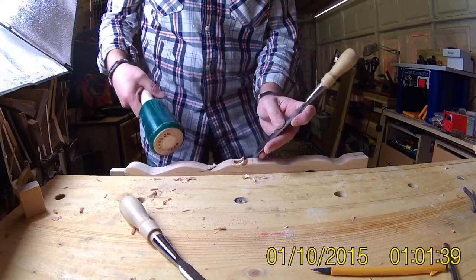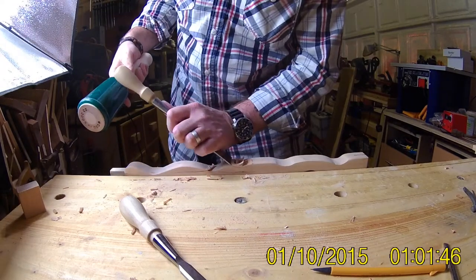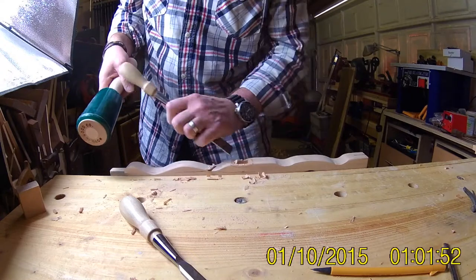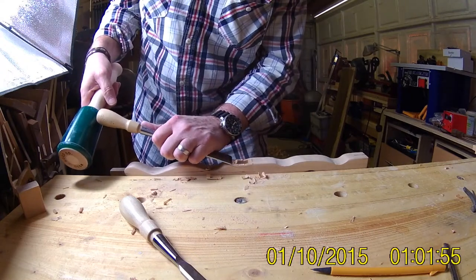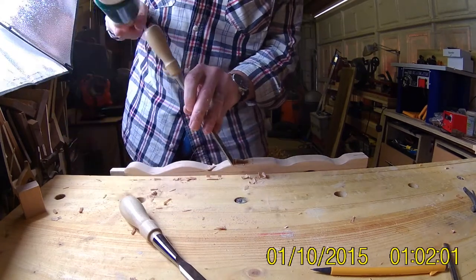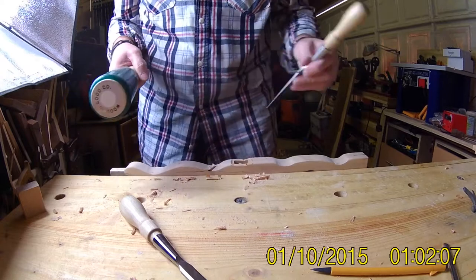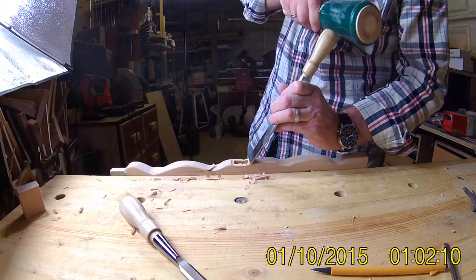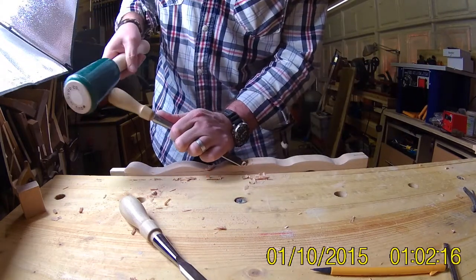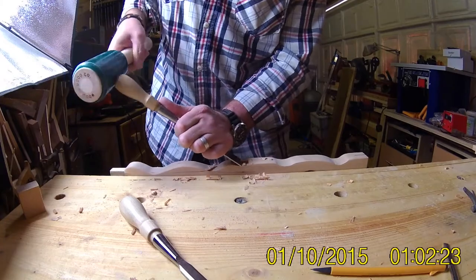I'm building this saw as I want it for resawing timber. This is where you have timber which is usually fairly thick and you want to cut down through the end grain and create individual boards from that thickness. This is something I've struggled with in the past, as the equipment that I've got hasn't enabled it to be easy. I've tried using the table saw, but because of the depth of the boards, quite often you can't get all the way through. And as I said on my other video, I've had problems with my table saw not cutting squarely, which I'm hoping I'll be able to resolve soon. So I'm looking forward to using this saw, and hopefully you'll see it in action in the future.